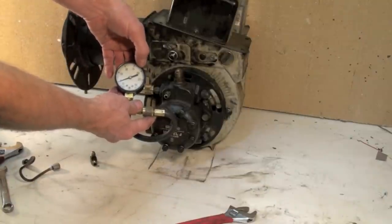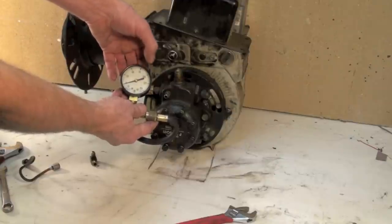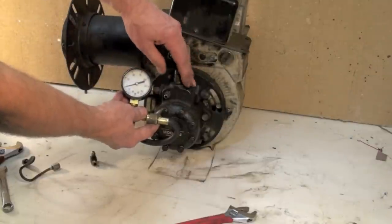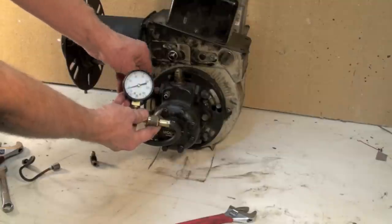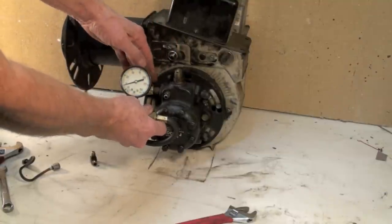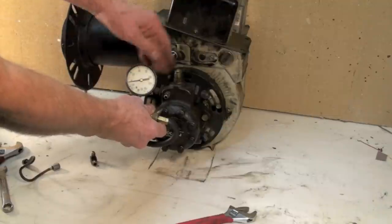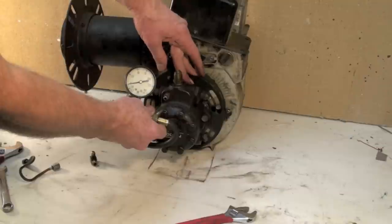When it stops, the pressure should drop 20 percent. So if we have a 100-pound pump, it'll drop to 80 pounds. It should be 20 percent of the on-pressure and it should stay there. If these fittings are all tight and leak-free, it should hold. If it bleeds down and the pressure drops, that means the regulator is leaking by — the regulator is failing.